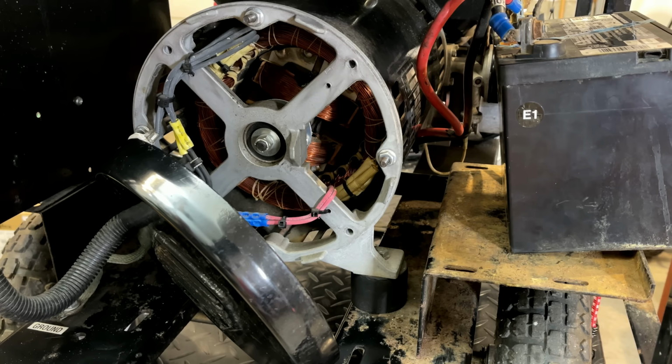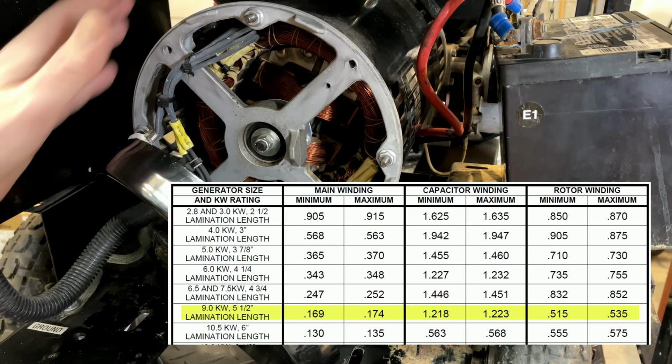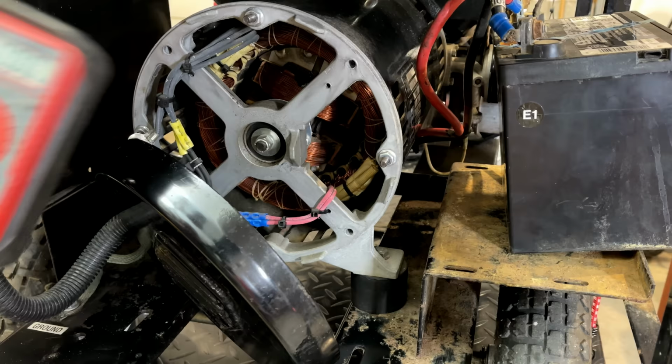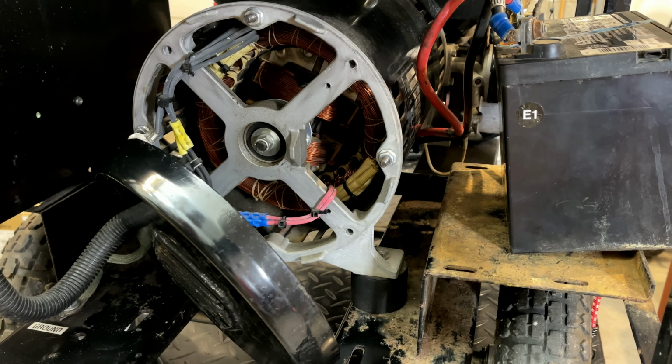It's the next day, and I did some research. I was able to locate a service manual for this generator. And for the most part, the testing we just did agrees with what that manual says. That manual also has a chart of the good resistance values for all the windings, and for the most part, it seems to agree with the results we got. Granted, this meter is not very accurate for super low ohms tests, and this manual actually lists the resistance to 3 decimal spots, which this cheap meter cannot do. So I do want to get a more precise reading.